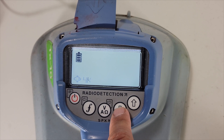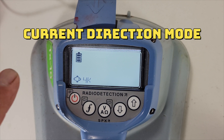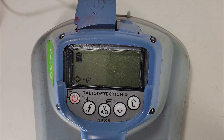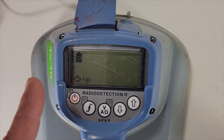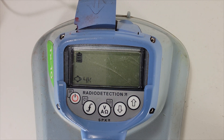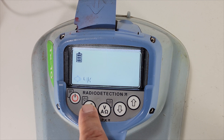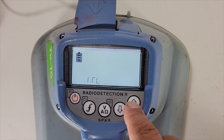You've probably noticed this symbol here — the directional current symbol. Directional current will point on your receiver which direction your current is flowing. If you pair the RD4K with your receiver, you'll see the symbol on the receiver with an arrow pointing which way your current is going — up or back. I'll show you that during the receiver demonstration. Hit F key to get back out. That covers frequencies.